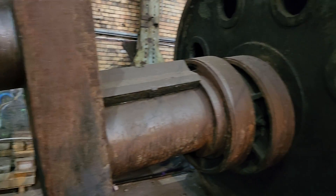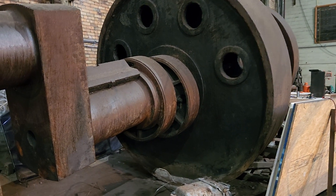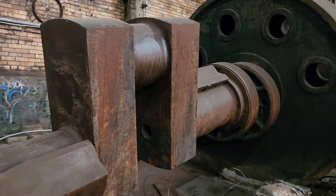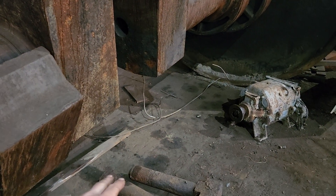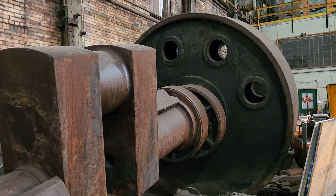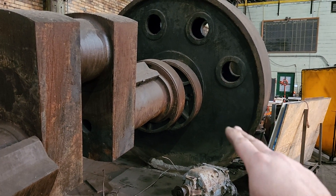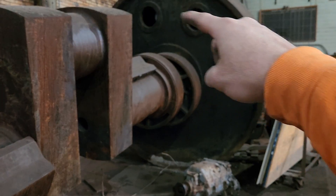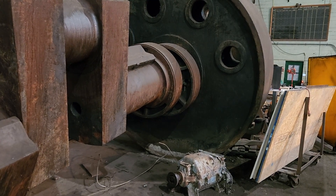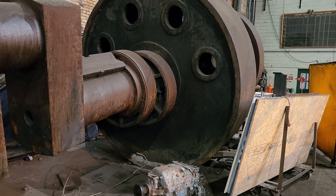The crank pin looks okay. Now, you might look at this and say "that's a flywheel" — but that's actually not a flywheel. That's what McIntosh Hemphill called a balance wheel. Normally on a big steam engine like this you'd have a lot of weight on the other side of the crank to counterbalance it. What McIntosh Hemphill did instead was cast this piece hollow up top but solid down below, putting that extra weight down there to balance the crankshaft. As far as I know, this is the only engine maker that did that, and this is the only surviving example of a balance wheel.